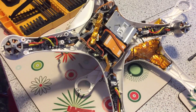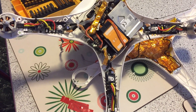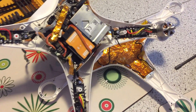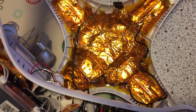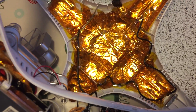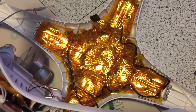Quite a few people have been asking us to open the quadcopter back up and show the mod we did to get the number of satellites when the camera is turned on on some of the older Phantom IIs. Here's what we originally started with — this mod that had been shown on YouTube. We ended up grounding everything together and soldering a ground wire to each of these sections, which gave full ground continuity. That helped a little bit, but not nearly as much as this latest mod has done.